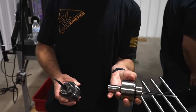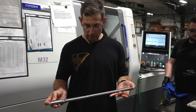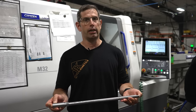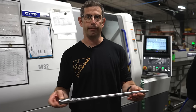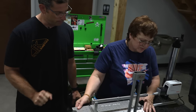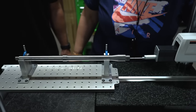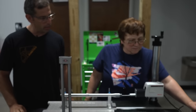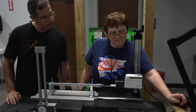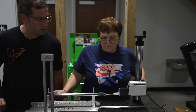And here is our custom ground finished chamber reamer. This barrel, TK1980, is an 18.7-inch 9mm direct blowback for the Canadian market. Ella's checking the surface finish on the 5.56 mid-length .223 barrel that we've been walking through the process on. This is called a profilometer, and our surface finish reading is 15, which is very good — our spec is 32.